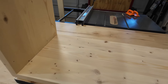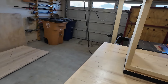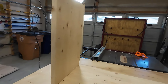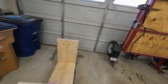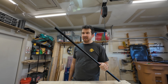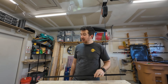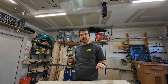The next step is I need to finish the top. I need to put in the tabletop stiffeners and then assemble everything. I'm going to use pocket holes to attach the top. I also need to make sure the holes are a little bit wider so there's play for wood movement — all this wood's grain runs in the same direction so it should expand and contract together, except for the cross pieces. I'll use a washer or two to give it some play when I screw it in.